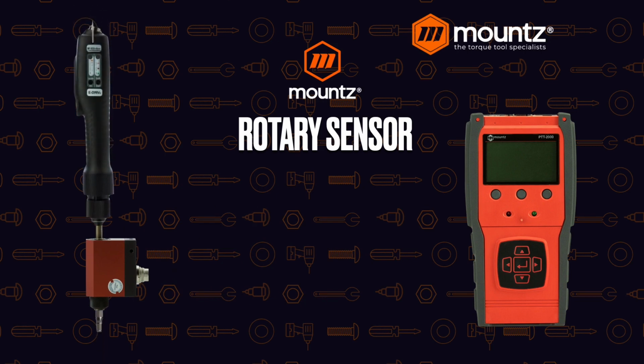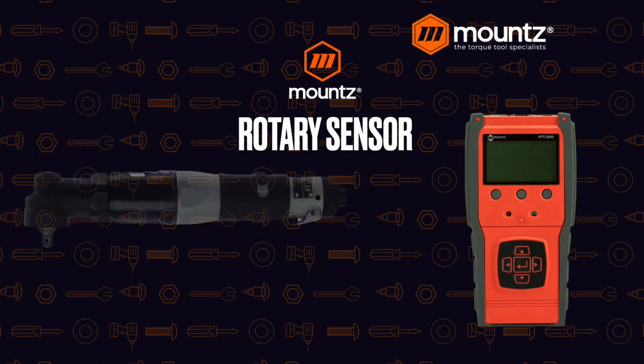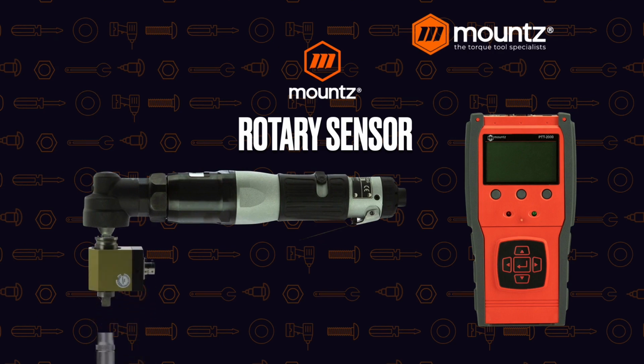And so with the rotary sensor, we can use electric clutch tools. We could also use pneumatic clutch or pulse tools with that. And those can have different configurations. It could be a right angle tool, it could be a pistol grip tool, but the sensor works in conjunction with a torque analyzer, again, allowing us to be able to test our tool on our part.